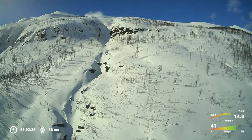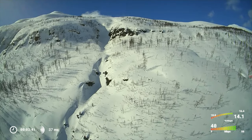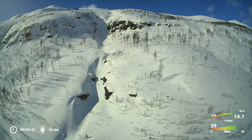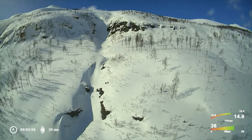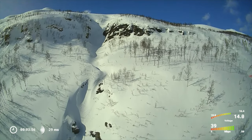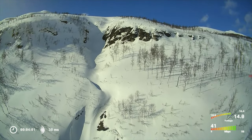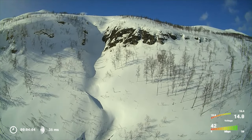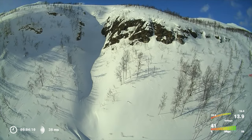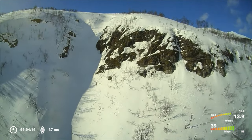What really happens up top is I make a turn to go back, and once I make that turn, the crossfire antenna on the drone is pointing straight towards me. That's called an antenna null — basically when the antenna is at its worst for sending and receiving signals. It couldn't get any signal from my transmitter, and since my transmitter wasn't transmitting enough power, that combined with the antenna null made my drone go into failsafe mode. Since I didn't have GPS, it basically fell straight down.